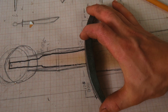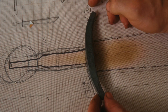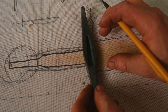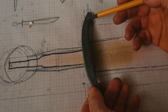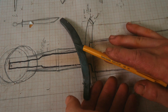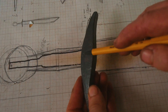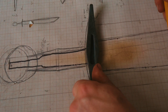So here we go. Plenty of stuff to work with. We have extra length on both ends, which is beautiful, because that means we're going to be able to grind down the ends, cut down the ends, so that it keeps this and the hole that we're going to have to make in our guard central to the blade so that either side we have even tines. I have a think about what finish I want on this — whether to polish it and do something to it, or leave a forge finish. It does look rather nice off the hammer, but we are going to have to grind the backside to make sure it is flat to the rest of the assembly for the hilt. For now, that is on the back burner.